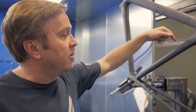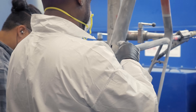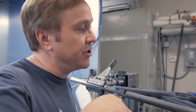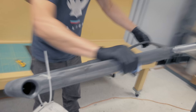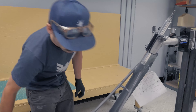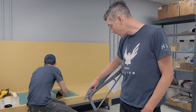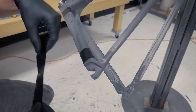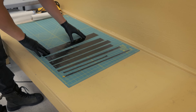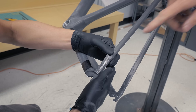In the sanding and paint prep area, we do the drillings for the water bottle cages, the front derailleur mount, and we drill and bond in all of the cable management systems. Randy's giving a final sand on the bond joint to make sure it's perfectly smooth and ready for paint. The bike's been sanded to get rid of all the excess glue from the bond areas. In all of these molded parts there's a bond joint designed into it, and including that bond joint is a half-millimeter step for an over wrap. The over wrap is actually a structural component — Olivia wraps zero-degree plies around this, which are very strong in bending. So the over wrap serves two purposes: structural benefit and minimizing any paint cracking.